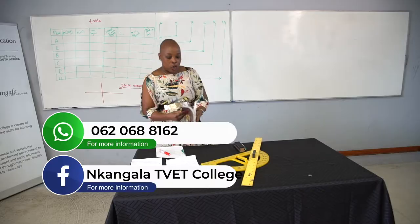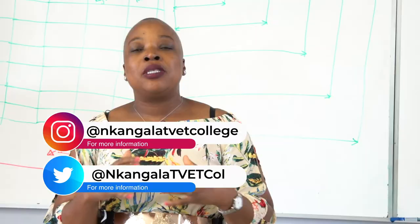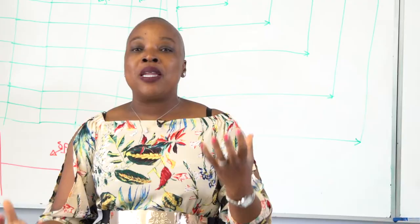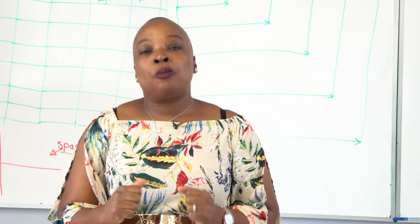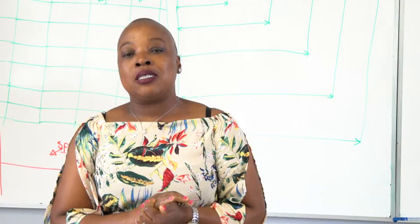This is the book. Today we're doing the lesson or module called balancing. We cannot have a shaft or a system in run without ensuring that the system is balanced. Like for instance, if we have a shaft and we put the pulleys, the flywheel, the gears, we need to ensure that there is a bearing supporting that system. If there is an imbalance or out of balance of the system, that can cause the shaft to bend. And when the shaft is bending, there's a stress on the shaft. That can cause excessive wear and vibration on the bearing. So it's very crucial to ensure that the system of the shaft is balanced, or it can cause the company a lot of loss in money and in time.